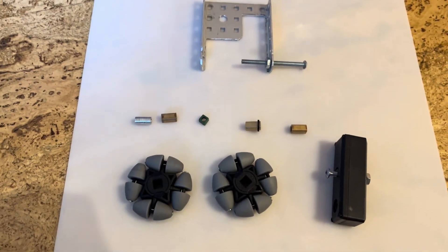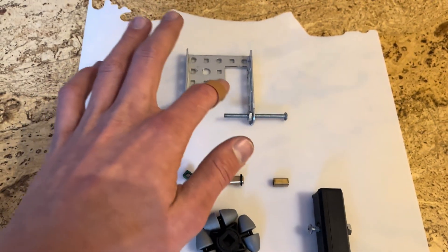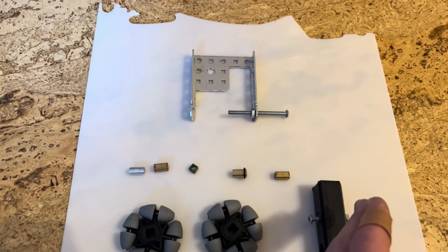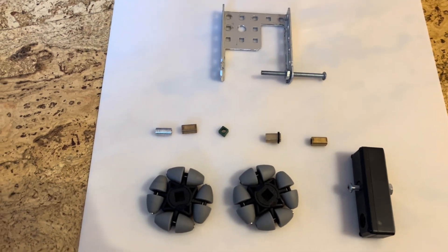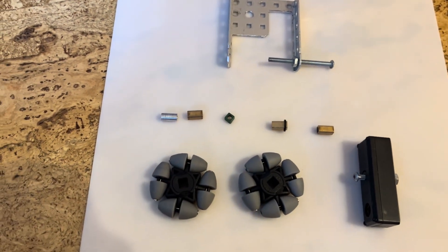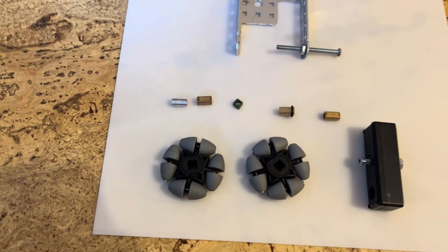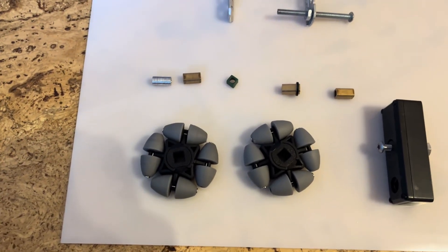In order to make this, you simply put everything on the rotation sensor screw and place all of the components on that screw. You also want to make sure you offset the omni wheels by 45 degrees so that there isn't a dead spot, which would be created if you used just one of the two-inch omni wheels.